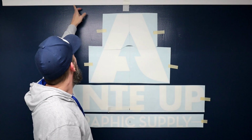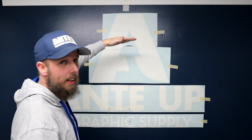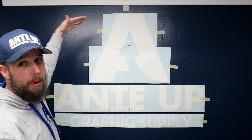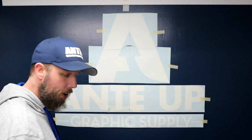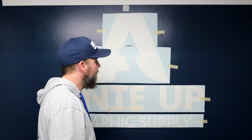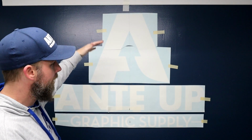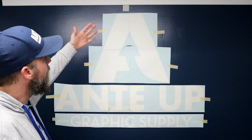So this is the most important part, is to pick which line you're going to go off of. I found that this molding here is pretty straight, so I'm going to measure down from there for everything so it keeps the line correct. Sometimes your ceiling might have a little pitch to it, so you don't want to go off of that. You might have to use the molding on the bottom or your floor for things like that. You could also use a level, but I generally like to pick something in the space that I can measure off of. So I'm going to start at the bottom measuring and then work my way up.